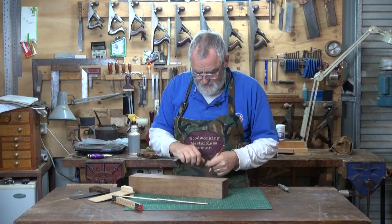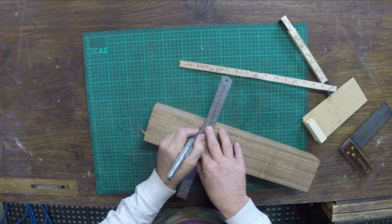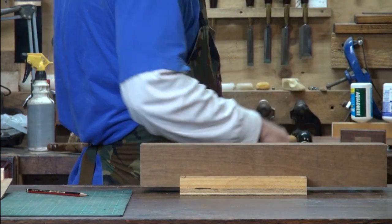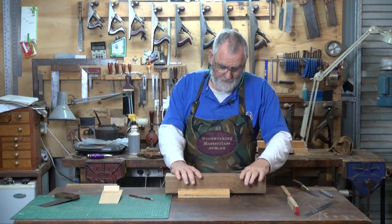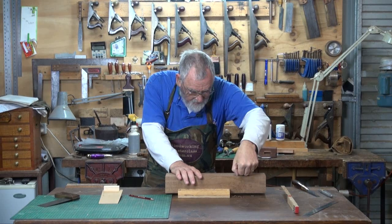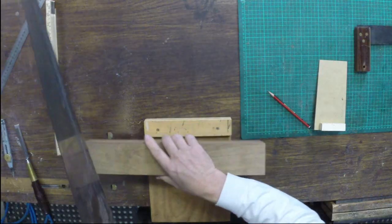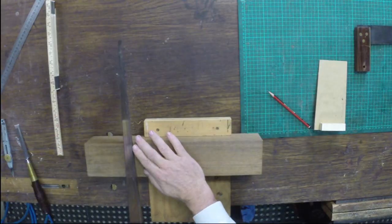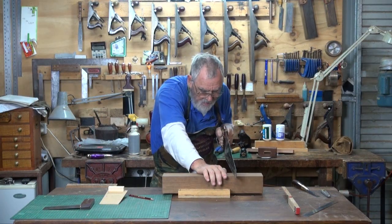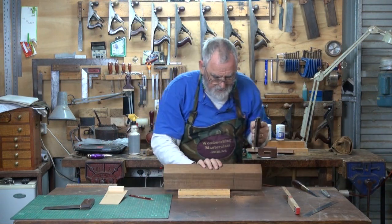What I will do now is just line that up with a ruler and with a sharp knife just score a couple of registration marks. Grab a bench, put that in there, I'll just grab a chisel and light up that line. Now I've got a nice fence to run the saw blade along. Then get your cross-cut saw. What you've got to be looking for is to line the blade to be cutting on this line as well as this line down here. We don't really want to variate off the line we're cutting. And if you've got a nice sharp saw, it shouldn't take too long.